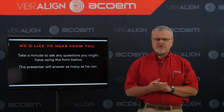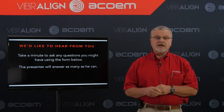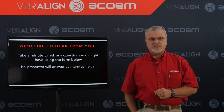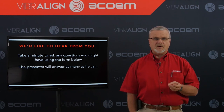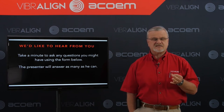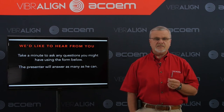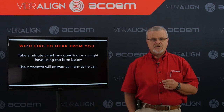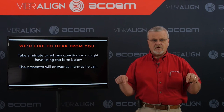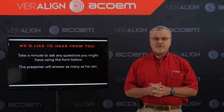Jose asked: what procedure could I use to detect misalignment with a data collector? I assume you mean a vibration data collector — that's a great question. I'm actually working on a presentation about vibration and misalignment and how they interact. Here's the problem, Jose: misalignment can show up as 1x, 2x, 3x, 6x — a lot of different things. Vibration is a good way to indicate the possibility of misalignment, but really the only way to detect and confirm it is by measuring the alignment. You can even check phase across the coupling — you'd expect a 180-degree phase shift — but even with that, you really need to check the alignment to verify whether it's good or not.